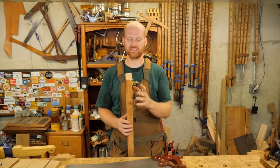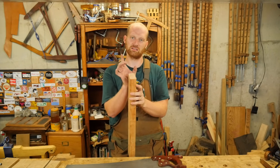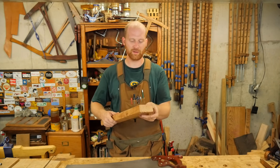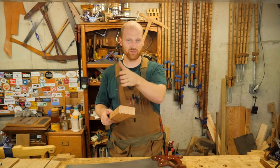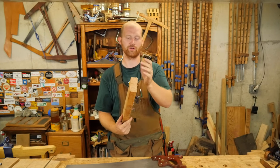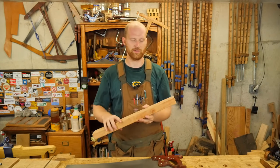What is re-sawing? Basically, re-sawing is taking a board that is X number thick and making it thinner. If you are ripping something, you are going through the thickness of the board. If you are re-sawing, you're going with the thickness of the board. And if you're cross-cutting, you're going across the board itself.